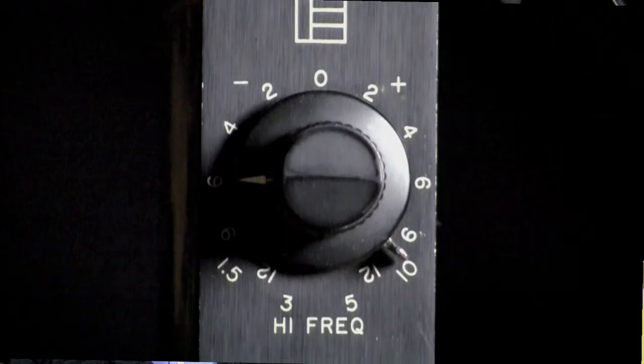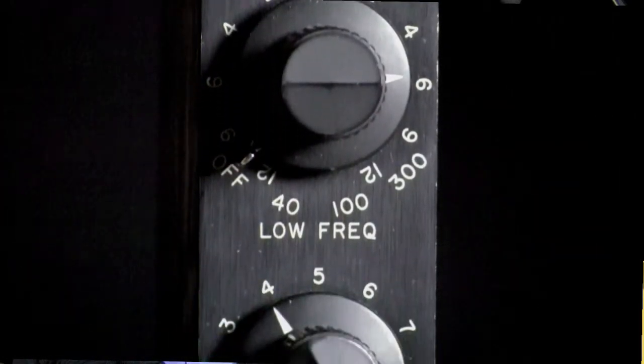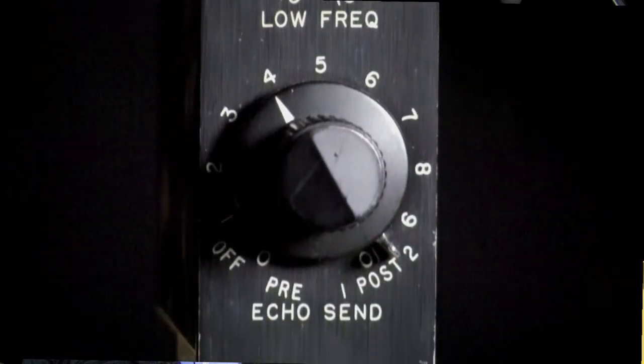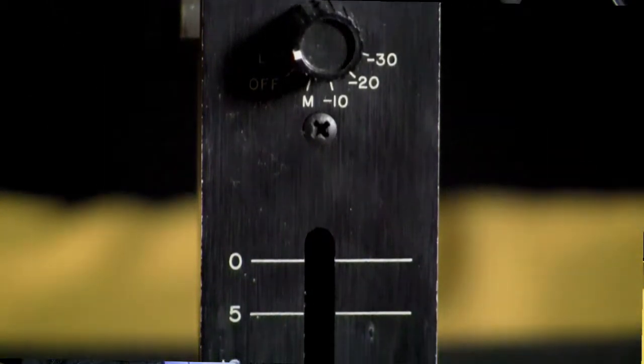And a normal microphone, like a ribbon or a dynamic plugged into that, doesn't see the 48 volts, doesn't even know it's there. So in theory, you should be able to run your ribbon mics and your dynamic mics with phantom power on without a problem. And in fact, that's true, because in the early days of my career in recording, most consoles did not have provision for turning the phantom power off. It was on all the time. And we used ribbon mics and dynamic mics all the time, and it never caused a problem.